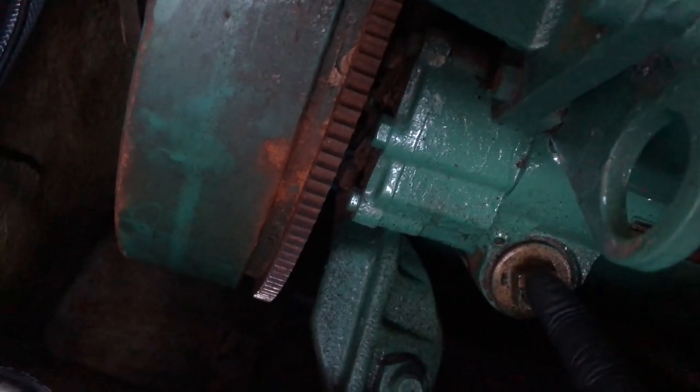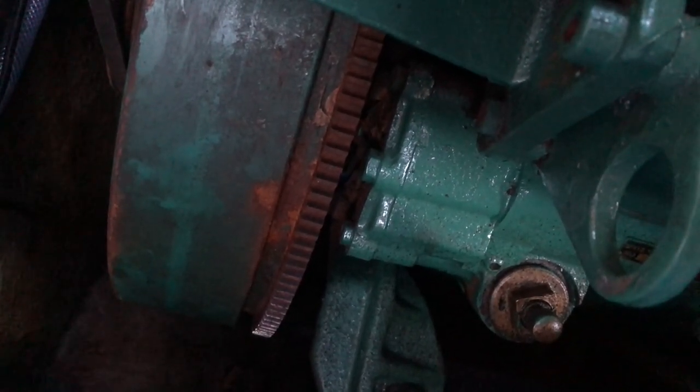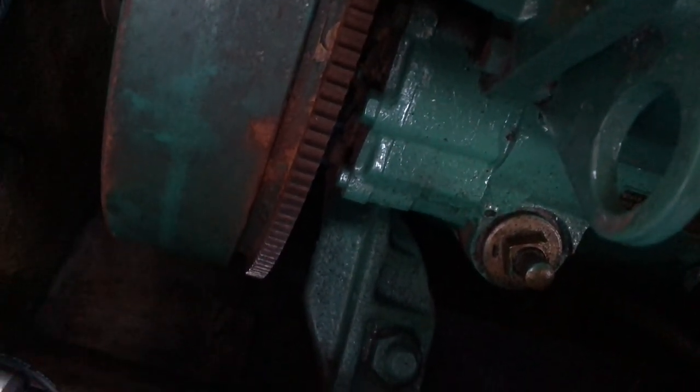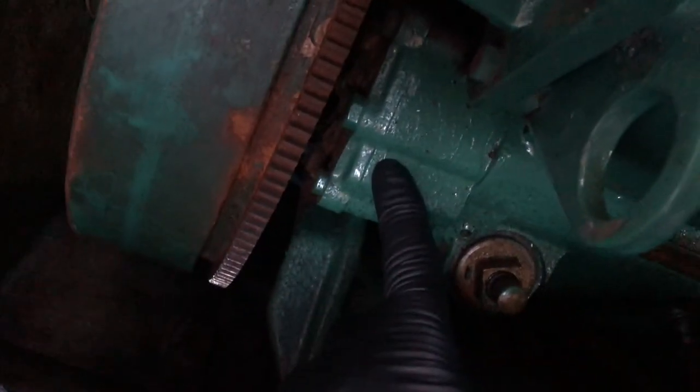This right here, this is the dipstick, the dipstick tube. In the service manual, it says that you should unscrew this and remove the strainer and pump the oil out. Well, the problem is they revisit that in the newer manuals, because underneath this there is a felt washer. And if you don't get this as tight as you are supposed to, or there is something wrong with this washer, you will have a vacuum leak, because this is the oil pump.